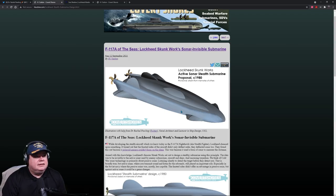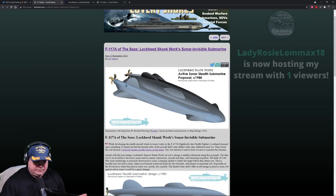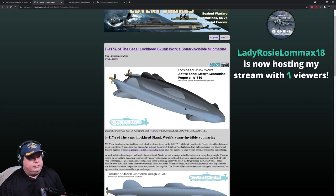Responding to viewer questions: how does the faceted design affect hydrodynamics? It affects it a lot — it really slowed the submarine down, which is why the Navy didn't buy it. During the Cold War, the Navy wanted speed, and stealth came second. The only exception to that was the Ohio class where stealth was everything. Because the design sacrificed speed significantly, they didn't buy it. The two-screw design was meant to make up for the lack of speed, but this would have actually made it even noisier — so while it was active sonar stealthy, it certainly would not have been passively stealthy.